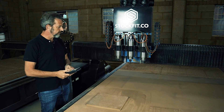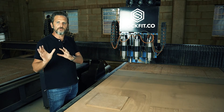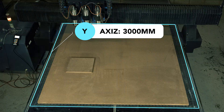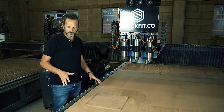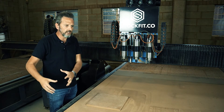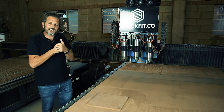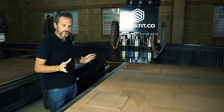What happens is the machine basically gets to its point where it starts with a zero-zero point based on the machine itself. The machine needs to know what its limitations are. In our case we've got two meters across on the X and three meters towards the back on the Y axis. The Z axis is a standard 150 or so, but that's not as important here. The machine goes into its home position and reaches its limit switch on the side. The gantry and spindles move until it hits its limit switch again, reaches its maximum point, and can't go any further. Then it knows it's in this corner and can work from there.